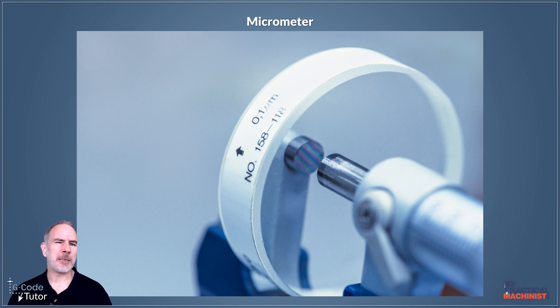This gives us a visual guide on where any high spots may be on our anvil or spindle mating faces. As we look through the glass, we see an optical illusion that gives us a pattern. If we use a monochromatic light, we can see this pattern a little bit clearer, so often we do that in the inspection room. Once we look through, we might see a few patterns on that glass, and this is what those patterns mean.